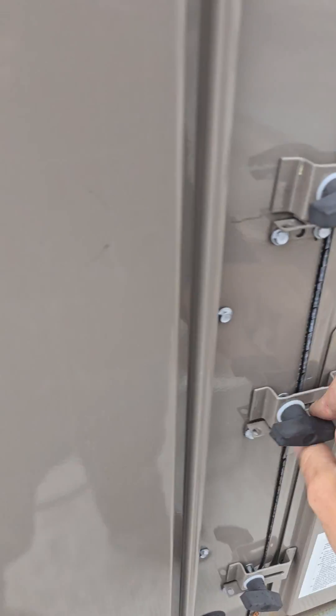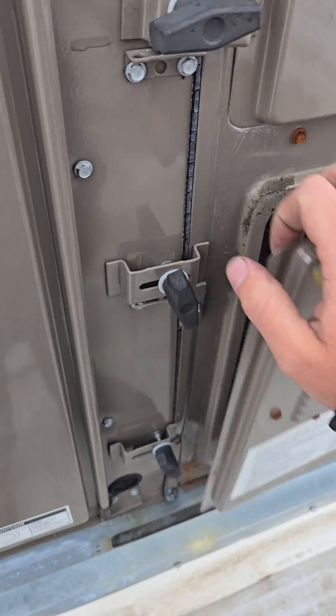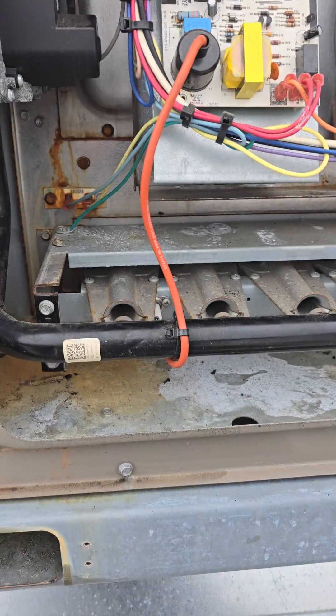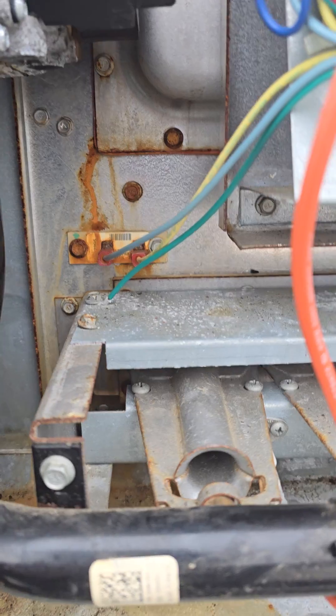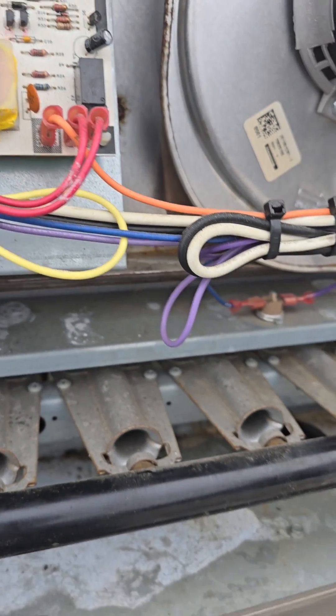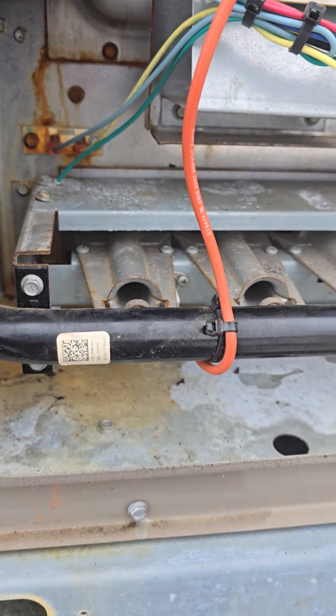That HS1 fault means something's going on with our heating limits. Right here, this is corroded and needs to be replaced. This was flashing at the time — the limit switch had opened, I tested that out and it proved to be bad.